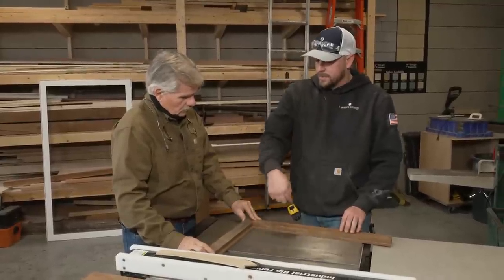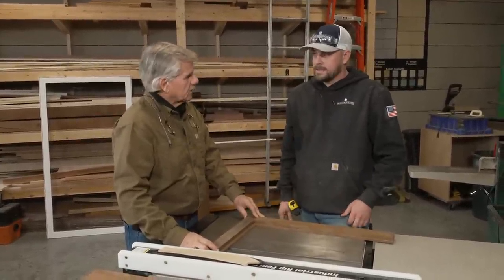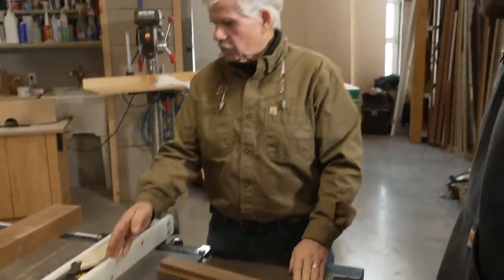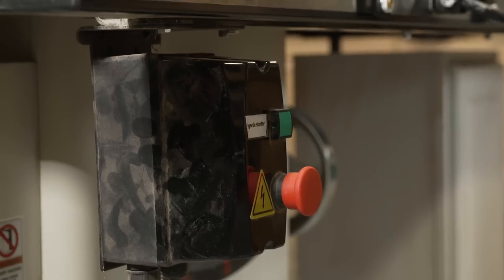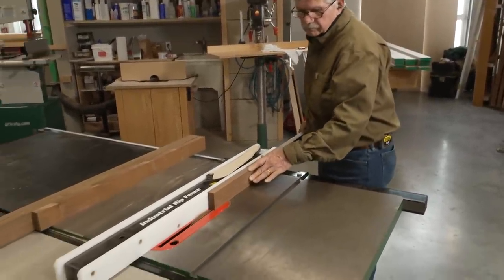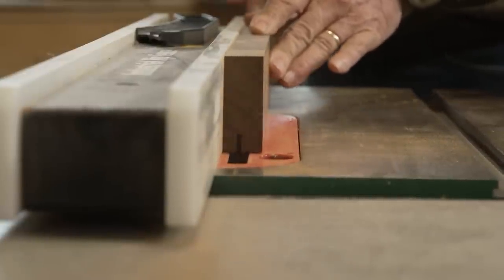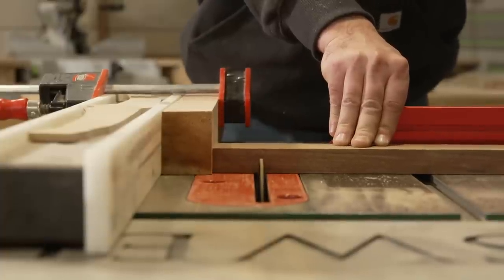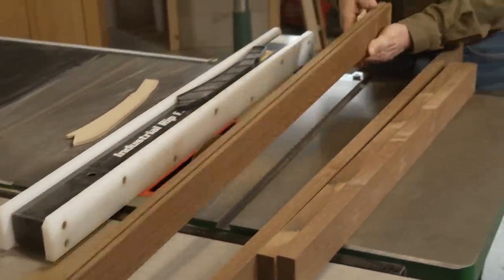So once it's all glued and put together, we're gonna put a 1/4 inch laminated glass, and then we've got stops that are gonna be pinned in from the outside. So if you ever have to take that out, you can pull the stops. Exactly. Yeah, that's great. Okay, so you wanna get started? Yeah, let's do it. All right, so you saw set up here, you've got some wood. Why don't I start cutting the rabbets and you can set up that other saw? Sounds good to me. All right, now I gotta reset the saw to remove that piece.